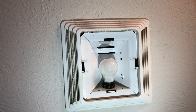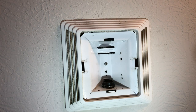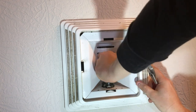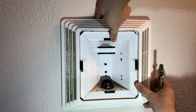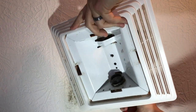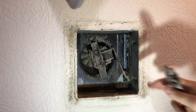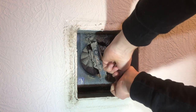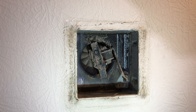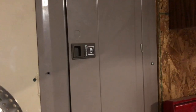You could have taken this down, which I'm going to show you in just one second, but I think it's better while it's up there to go ahead and get all the stuff out of the way. The next thing you're going to do is unscrew the light bulb because we will be taking this off and actually cleaning it in the sink in a few moments. Some of these you can pull off by hand; some will need a pair of pliers to get started. Get that nut off and continue to hold that up because underneath are two sets of wires. You're going to need to unplug the first one and then the other one is right here.